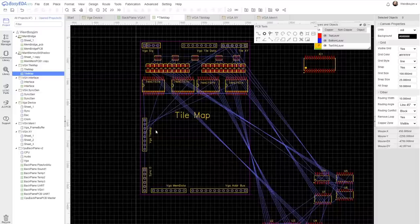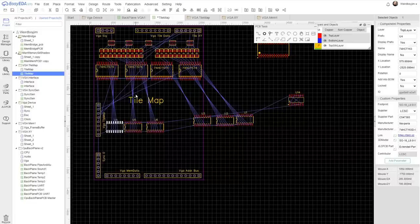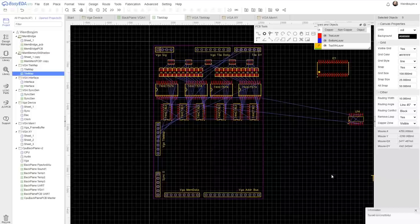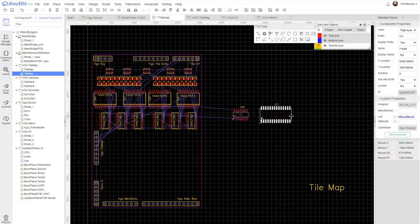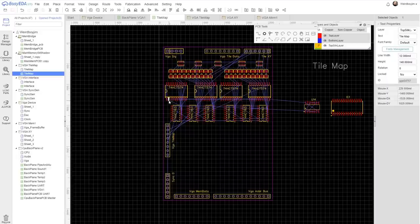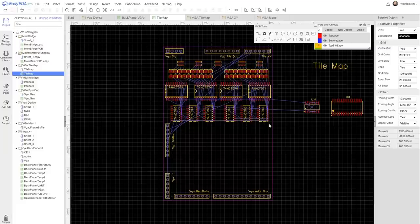Let's assume it's possible to route that. That'll be the NAND gates. Okay, so that's the registers and the counters on about half the PCB. That's a bit of a squeeze. It's going to be tough to route, but I feel slightly better about this. I do need to get the MEM data lines up to here. Actually, let's try a different arrangement.